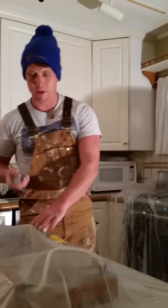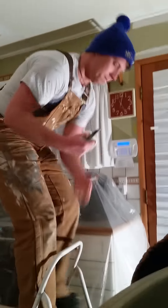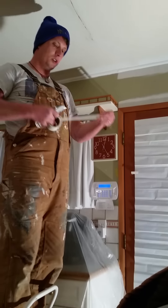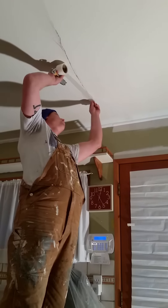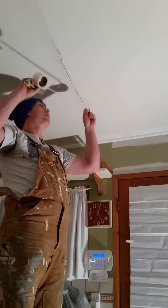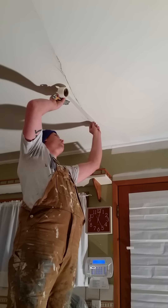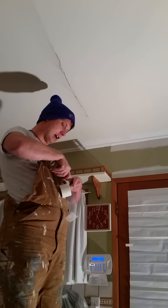Take your utility knife — be very careful, it's extremely sharp. It doesn't have to be exact, but you want to measure or eye up about how much fiberglass tape you're going to put on here. Most often times, as you can see, it's not a straight run, so we need to overlap and put quite a few pieces on there as you move across the crack.